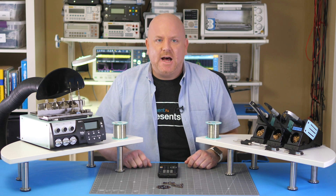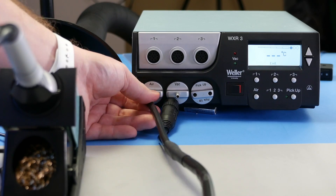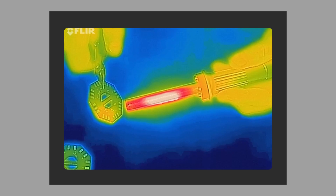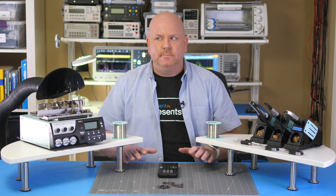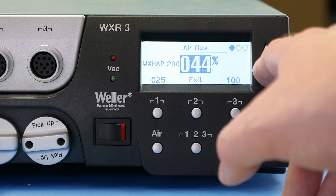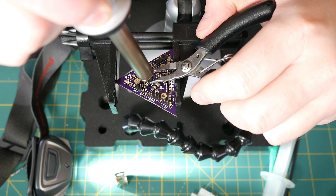When working with surface mount parts, a hot air tool is very helpful. Here is Weller's WX-HAP200. It connects to the WXR3's air port. When you press the button, air starts flowing through it. It does take a few seconds to heat up to temperature, but that's a good thing — it helps to prevent thermal shocking the components you're trying to repair. For smaller ICs, you do not need any additional accessories, other than flux. Let's combine these two things and repair a custom Arduino board. This one has a QFN 328P that needs to be replaced. On the WXR3, I drop the speed down to 25% and remove the nozzle from the HAP. Then I apply heat and after a few seconds, that little chip comes off with no problem.